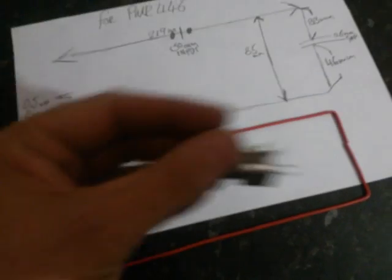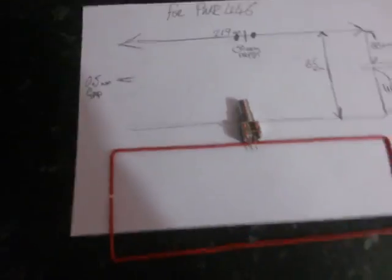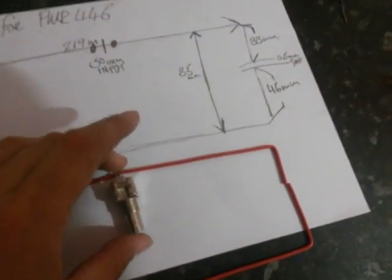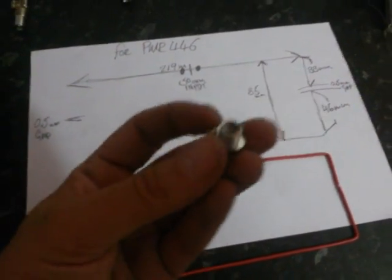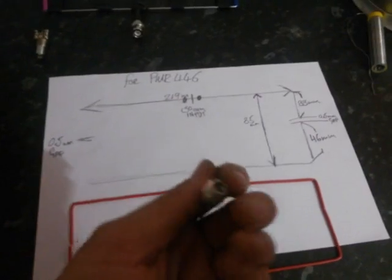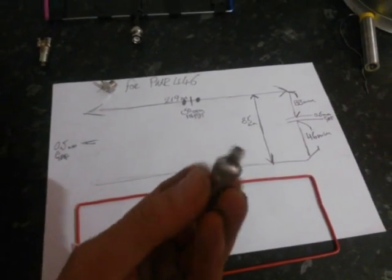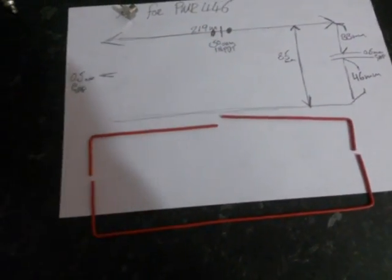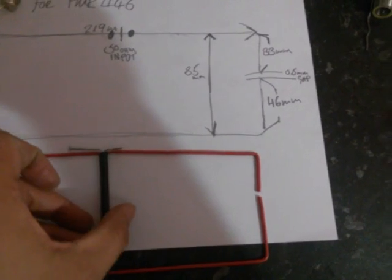A BNC board mount — it has individual tags, so you could either have it like that or have its feet through. I personally like it through — it just gives more strength. There are also these little connectors, the same as you get on dual band handies, and of course these which you can connect straight to a radio. For this version, as it's going towards a dual stack or possibly a yagi or quad stack, I'll be using just a short piece of coax.